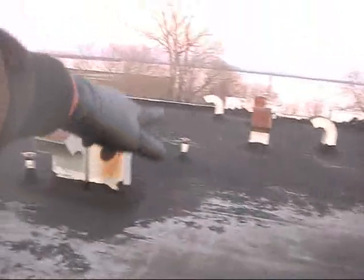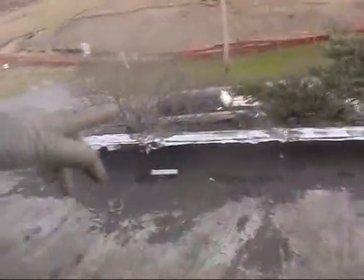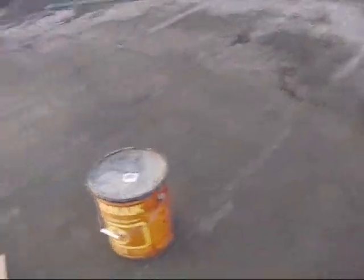You get ponding. Look at this. It's just sitting there, looking for a crack in the rubber. So when I put a little bit of pitch in here, just a little bit, not a lot, the water will gently run to that drain right there, or that one right there. I'm not going to pitch it off the building, because then you have a problem with ice dams and water runs down and affects the porches, and there's all kinds of stuff there, windows that don't seal very well, so I'm not going to do it there. I'm going to pitch it in the middle, and there's air leakage through this roof. It's not a very tight building. It's tight enough that the electric bills for the heating aren't too bad.